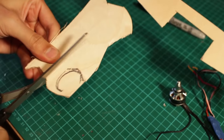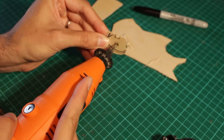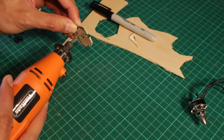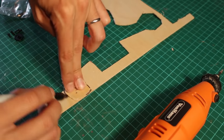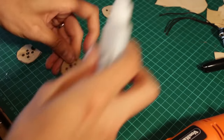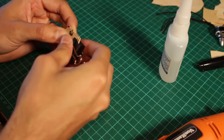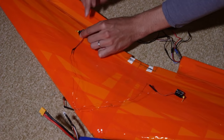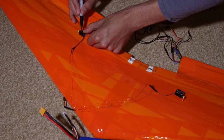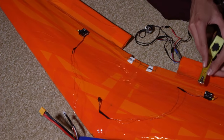Now it's time for the electronics. I'm going to make a base for the motor, which should be the strongest part. I'm using plywood with several layers so we can mount the motor in place and use long screws. But be careful — if you use long screws with a thick base, the screw can go too far and damage the windings of the motor.